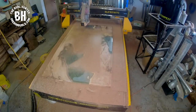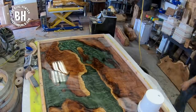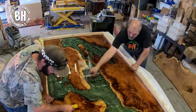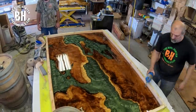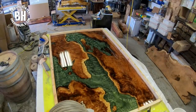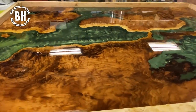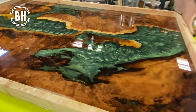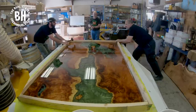Here's where the true beauty starts to pop on this project. We had to remold it to make sure that we had a thick enough layer of epoxy on top. With every top pour that you do, remember you want to torch it three times, five minutes apart — but you don't want to heat up the epoxy, you're just popping bubbles. If you've done your seal coat three times and plugged up all of your holes, your pour should be glass smooth.